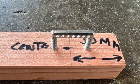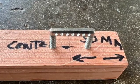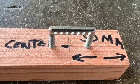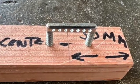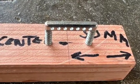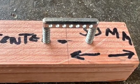The first thing to do is to mark the center of where you want the Lok-Dowel to actually go. I like 50mm as a nominal dimension from where you want the top of the board to finish. A minimum of 30mm, maybe 70mm would be good, but I like 50mm.